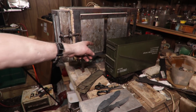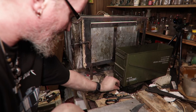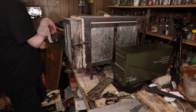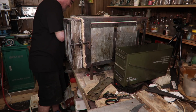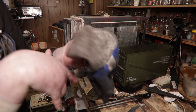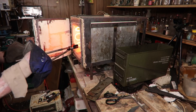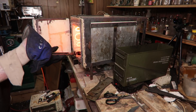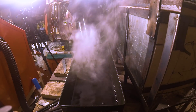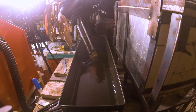Let's put them in and get them heat treated. I'm heating the oil up because once it goes in, it only needs five minutes in the oven — both of them. We're turning this off, that's at 120°F. Getting my gloves on because we are dealing with 1550°F tips. Got my tongs. Here we go — my first 80CRV2. With this we're not worried about differential hardening or anything like that, so we're going straight in. All the way in, keeping it submerged. The back doesn't need to be soft.